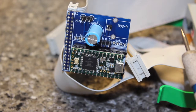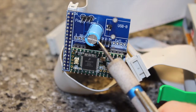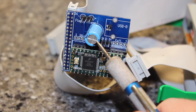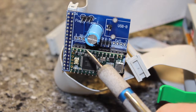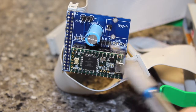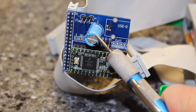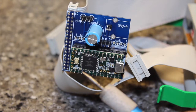The capacitor is actually not needed if your floppy drive is being powered externally. I'm using an ATX power supply for mine at the moment. What the capacitor does is — if you're using USB power, that can draw up to 700 milliamps. This is a 1000 microfarad capacitor, so it basically absorbs power fluctuations. If you use an ATX power supply you don't need that and you don't have to worry about power.